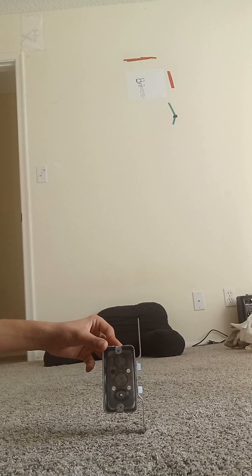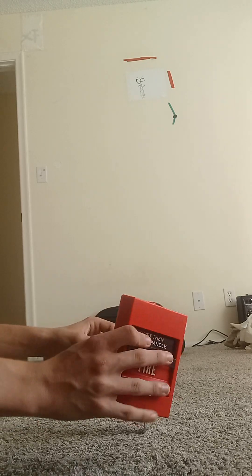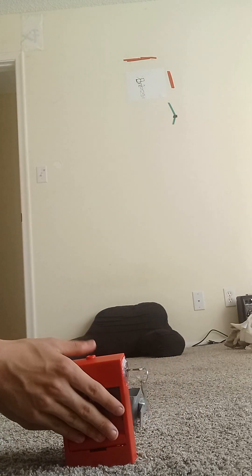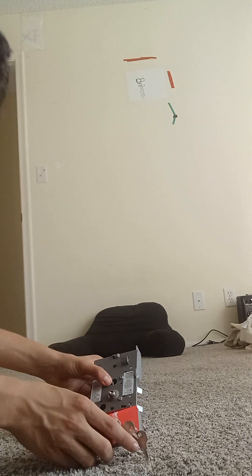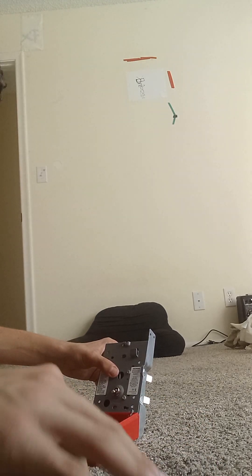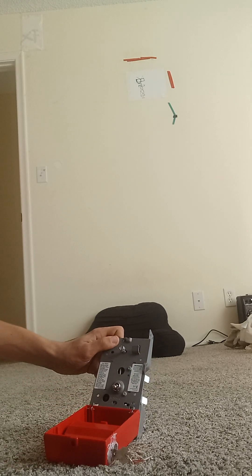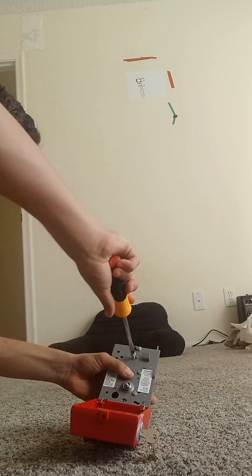You're going to have the wall right here with your wires coming through. Now you'll take a flathead screwdriver and insert into these two holes right here and into these two terminals. If those are secure, you're going to open up your device. You're going to take two screws — get your package of screws. You have to find where the hole is and then tighten it. You simply want to tighten the pull station screw and make it tighter.